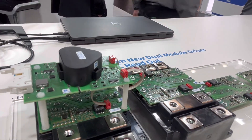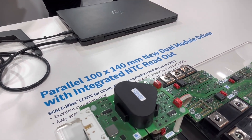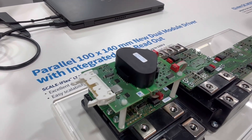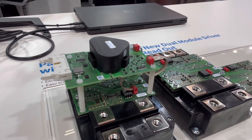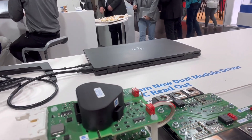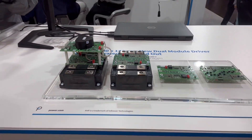Our product consists of an IMC, which is our integrated master control unit operating the connected so-called MEX module adapters, which are sitting on top of each and every connected power module. The purpose of the IMC is it receives the input signals from the superior control, from our customer's control unit. It processes the signals and sends them over the isolation barrier — a reinforced isolation achieved by this transformer. The signals are then sent as command signals with our line driver ASICs to the connected power modules.